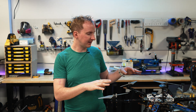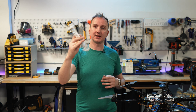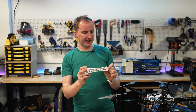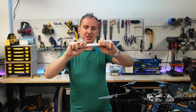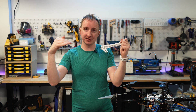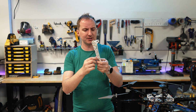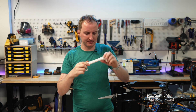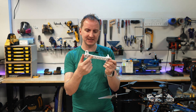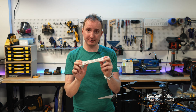When the F-550 kit comes to you, it doesn't come with aluminium arms — it comes with these. These are, I'm pretty sure, injection-moulded nylon arms. While they are not metal or carbon fibre, they are pretty rigid, very hard to bend. The key thing about a multirotor is that it is very rigid — you don't want any oscillation or the flight controller gets very unhappy. But these, for plastic, feel incredibly rigid. There's some good cross-patterning; it's pretty thick.